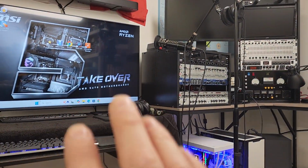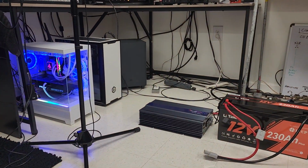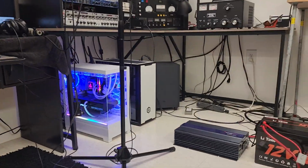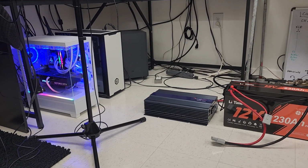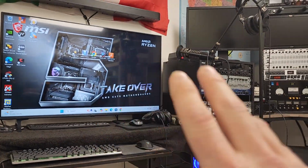It was all quiet, and one by one he started clicking on all the breakers. I could hear him in the other room snapping the breaker shut, snapping shut. All of a sudden he hit one breaker, and the interference went through the roof. All right, there we go. Now we can whittle it down further. He determined that breaker ran stuff in his living room.